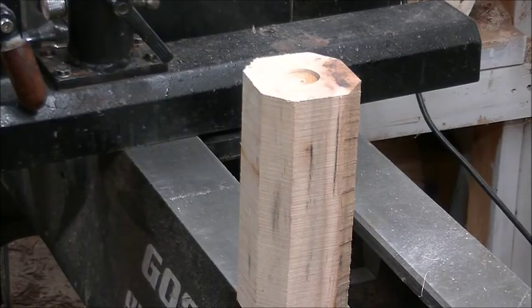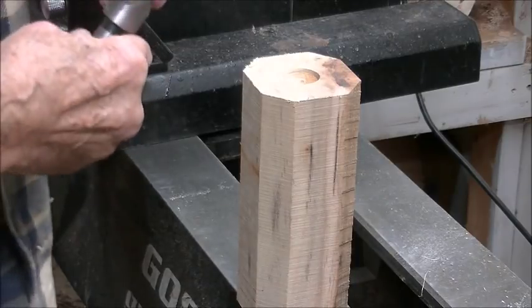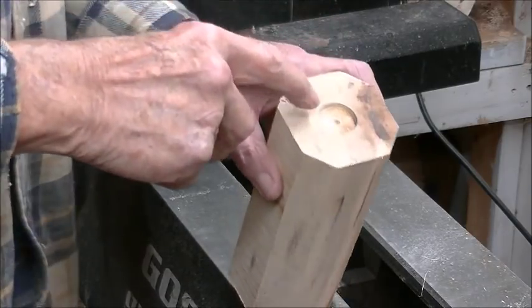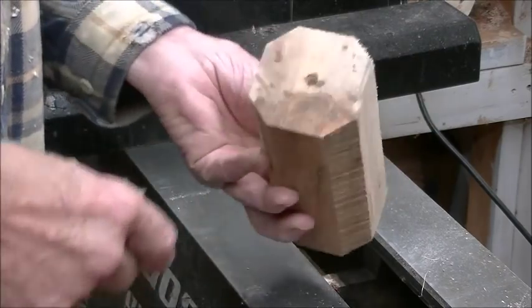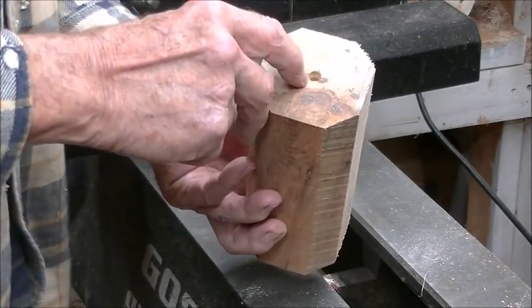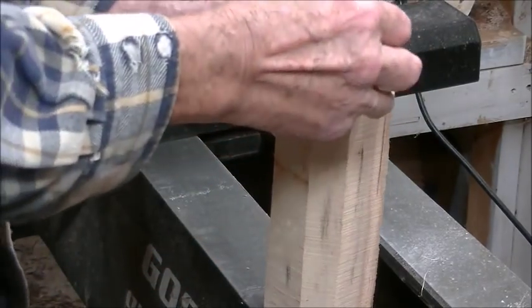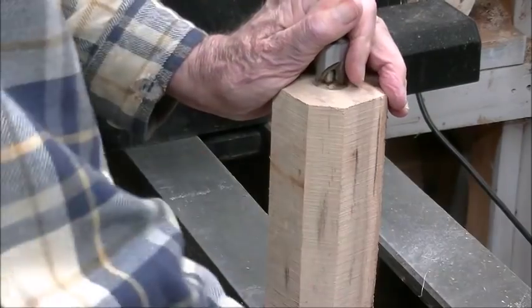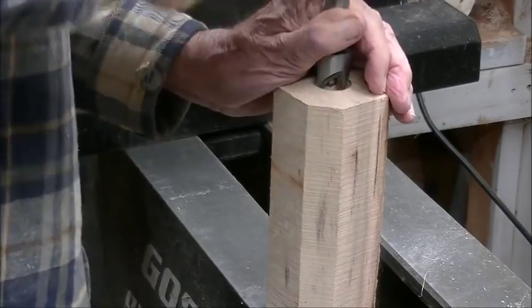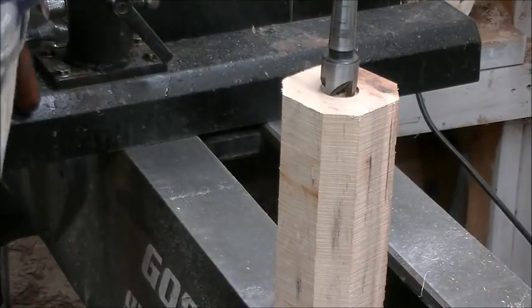All right, for you guys that are first timers or don't follow my channel, anytime I do spindle work, I do the exact same thing. I take a 1-inch Forstner bit and I make me a place right here for the drive center. And I come at the other end and I take a little step drill and I drill me a place for the live center. It's just something I've always done. When I first started, I had a couple of them come out on me and I don't like that. And then I take and do that to it.